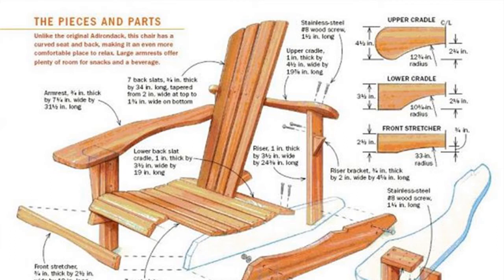1. Prepare the wood. Cut the 2 by 6-inch board into 2 34-inch pieces and draw a seat curve with a bump to support the back rail. Cut a 15-degree slant on the bottom, at the back of the rail, so it sits on a slant. If you want a curved back, route out the front edge of the bottom back rail so it's slightly concave. Cut the arms wide at the front and slightly narrower toward the back. Cut one end of back legs at a 30-degree angle for the top back rail to sit upon. Sand all edges and corners to prevent splinters and cracking.